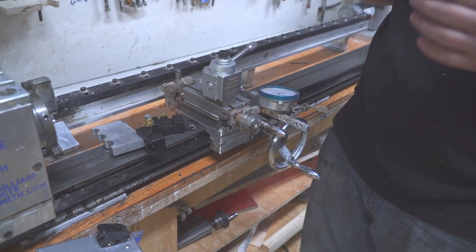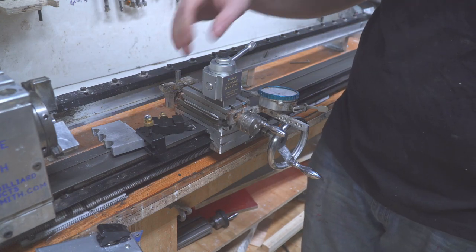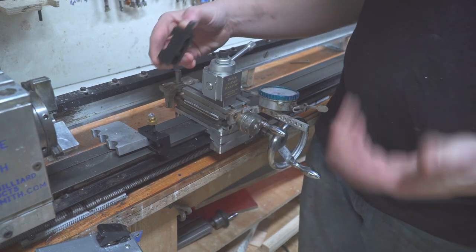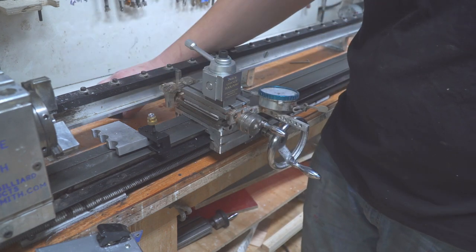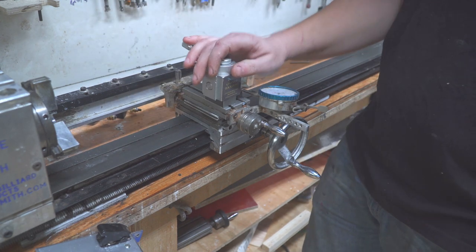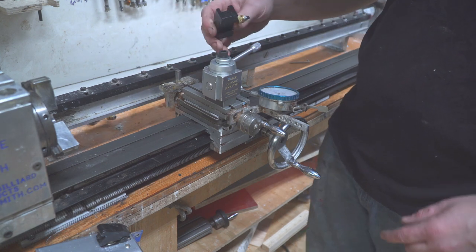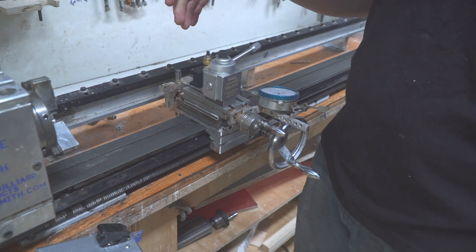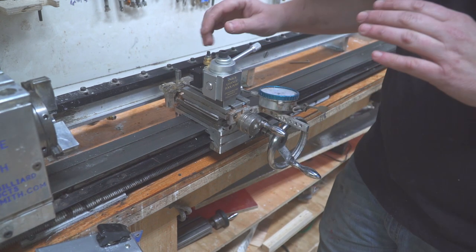That's the quick change tool post. I really like it — this is just my initial installation and review, but I think I'm going to love it. Here are a couple of reasons why: as I was doing the tip change, these are my main two tools. Being able to make my cut, move one lever, set this to the side, and now be ready to shape — we're good to go. That is so much easier and more consistent. Another thing I think will be really useful is putting a boring bar into one of these holders facing forward, so I can set my boring bar up how I want and leave it.